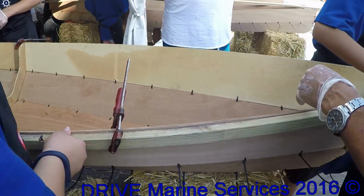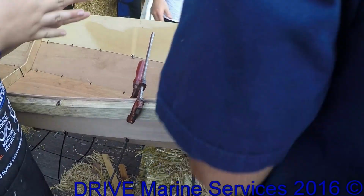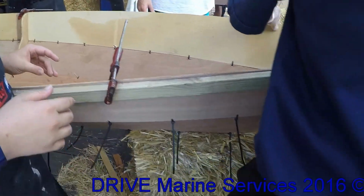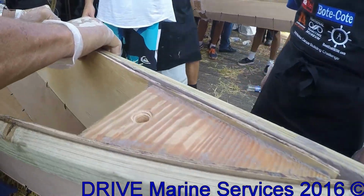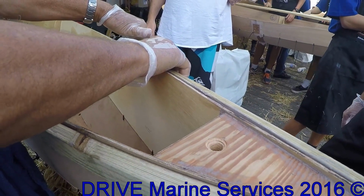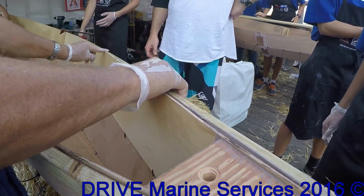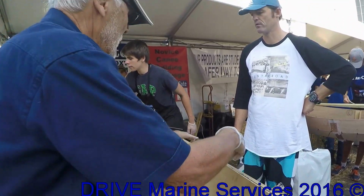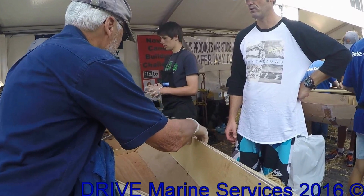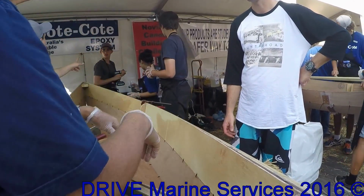Are you working anywhere particularly? Do you start in the middle? I do, because then it's usually matched up beautifully, as long as this is level or below, and we'll plane off what's left. Because we've got two different woods, it's almost impossible to get them to sit perfectly. So what we do is go for 5 mil up and plane it off later. But the big problem is that this has actually worked better than we normally get. There's usually a big gap under there that you've got to plane out.